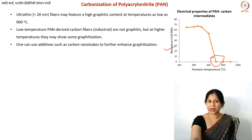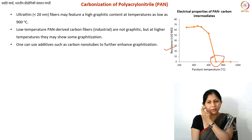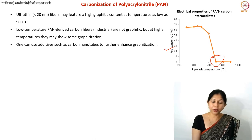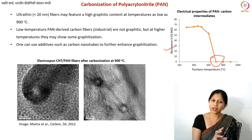At industrial scale, 900°C is considered a low temperature. With larger fibers typical of industrial production, you don't get much graphitic content at 900°C and would go to higher temperatures. To increase graphitic content — mainly for research purposes — you can add metal nanoparticles or carbon additives such as carbon nanotubes to your PAN solution before spinning.